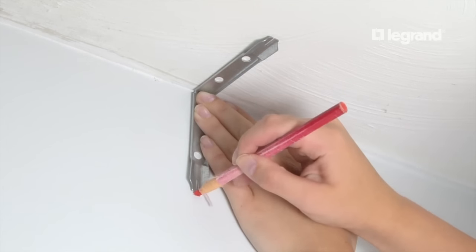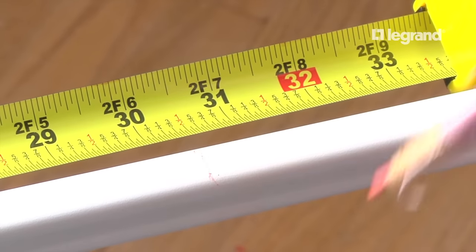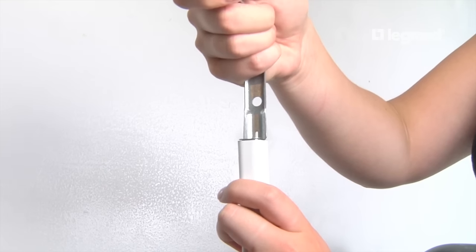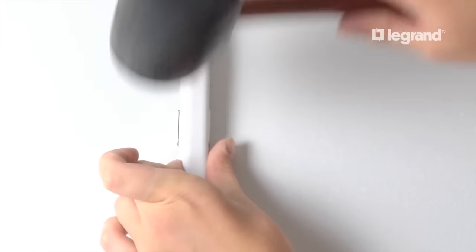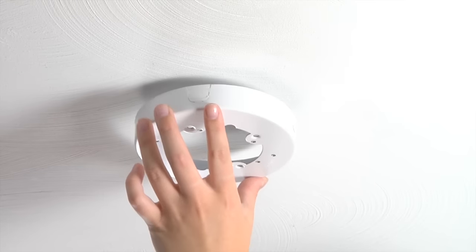In similar fashion, temporarily position the inside elbow base fitting in order to get the right raceway measurement between the top of the switch box and the inside elbow. Be sure to add three-eighths inch at each end to slide the raceway over each tongue. Cut and deburr the raceway and install the bushing into the cut end. Slide the elbow onto the cut raceway and then slide the opposite end over the tongue on the base of the switch box. Tap the raceway into the clip, then fasten the elbow base to the wall at the inside corner.